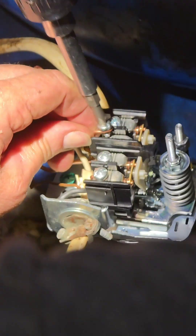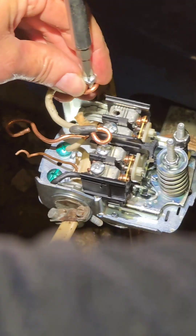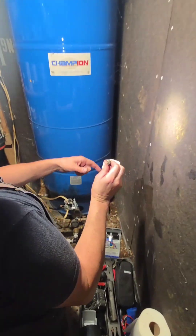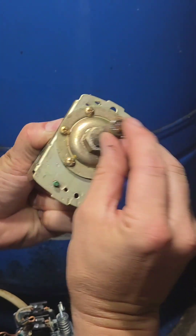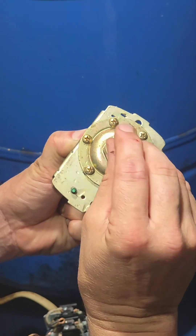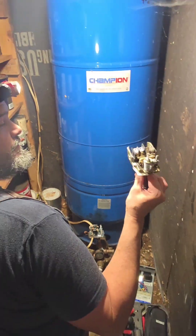Resetting the lock nuts and putting the terminals on the pressure switch. Transferring over to the sound of the video here. Look at that — these galvanized nipples corroded completely. There's no way this was reading the pressure through this pipe — it's completely clogged 100%. So the pump was just staying on 24/7. That's your verification right there.